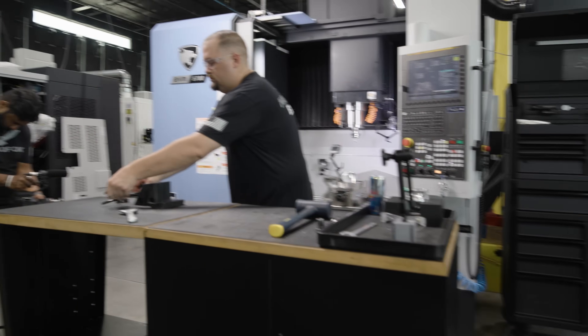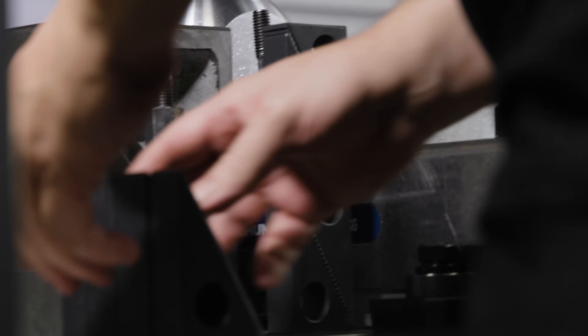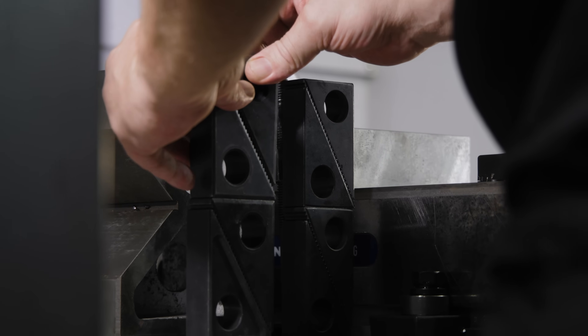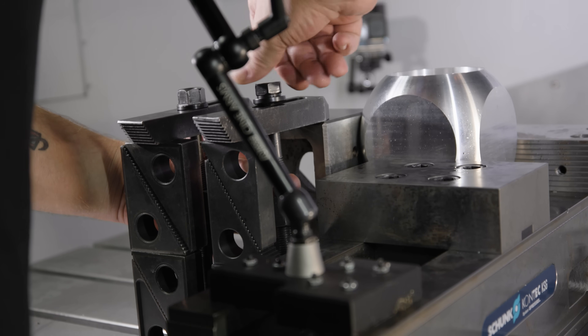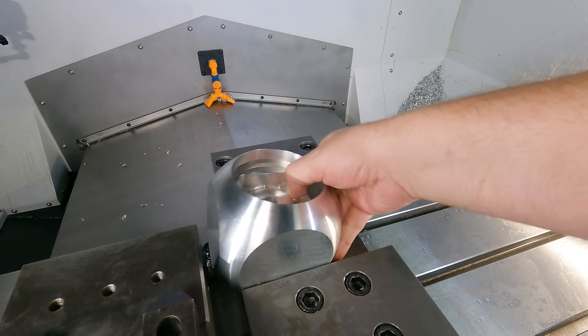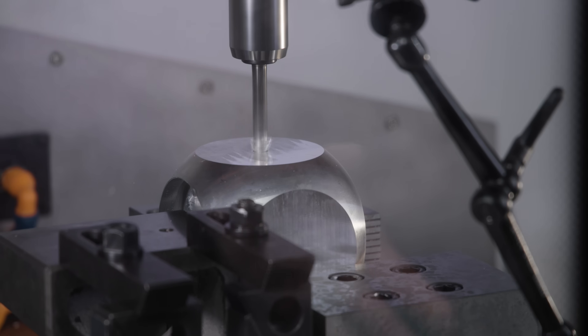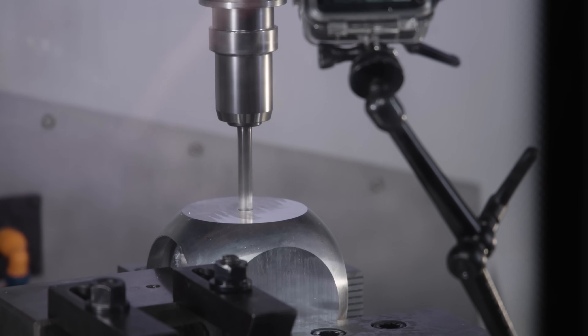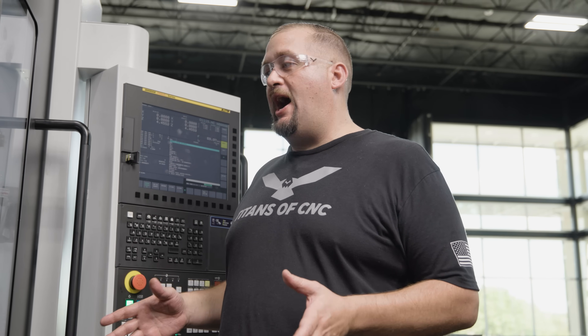Because I don't want to have to come in and probe on our sphere for the third side, we're going to put a v-block in and bolt it to the table so that I can push the part to the v-block for every subsequent side. Now with this TX drill, you'll notice that we're pecking, and the only reason that we're doing that is because we're running dry. If we were running coolant, we would just punch right to the bottom of this hole.